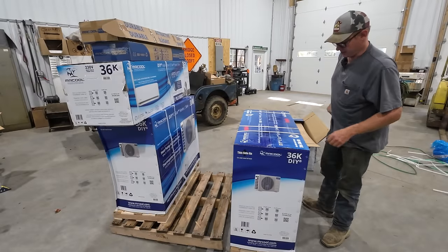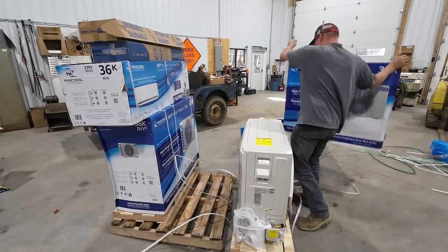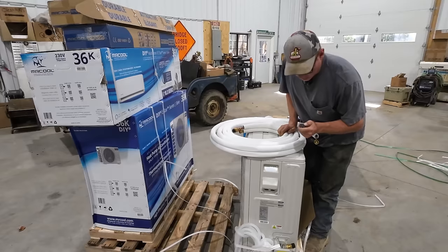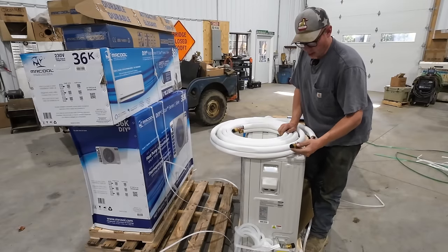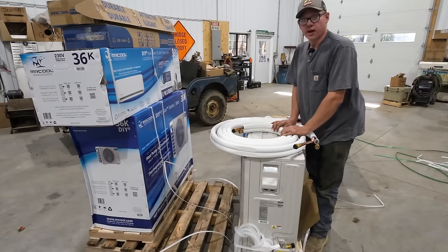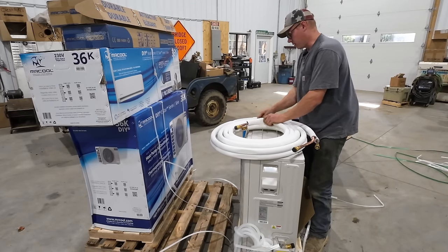Let's pop the lid off of this guy and see what we're dealing with here. Oh boy! Here's what makes this system really cool, and one of the reasons I went this route. These lines come completely pre-charged. All you have to do is screw them together, and they purge themselves out, and you're ready to go. There's no vacuuming and drawing in Freon or...